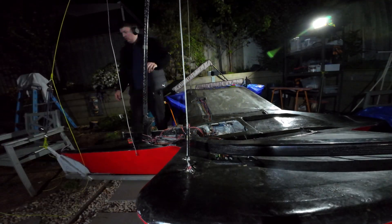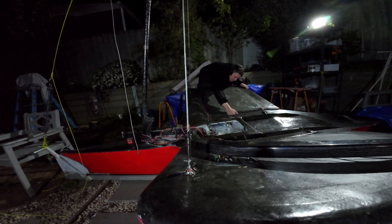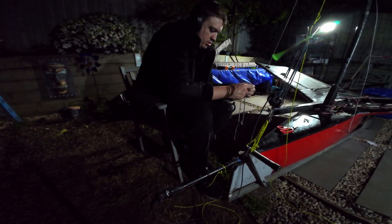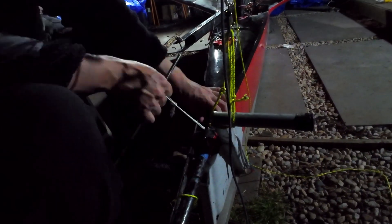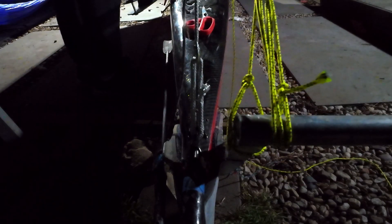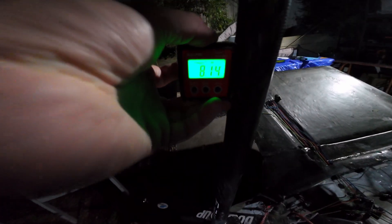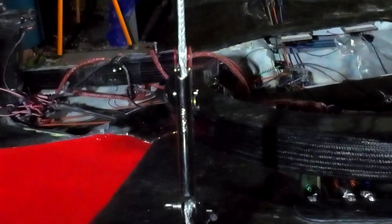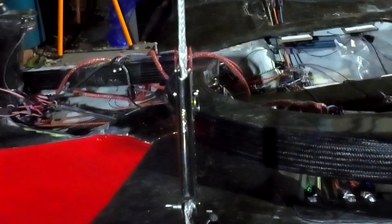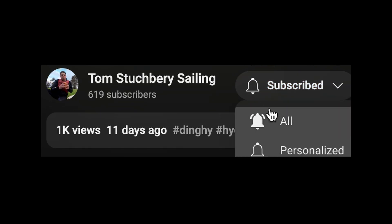In the comments, Rob USA 4301 mentioned you want about eight to nine degrees of rake measured from the flat of the hull on a Mach 2. I was able to end up at about 8.5 to 8.6 degrees, so I'm really happy with where it ended up. The soft shackle I'd made for the forestay with such care in the previous episode was now way too long, so I had to make another one. I'm really glad I did pre-stretch them properly, because they stretched from the top hole of the side stay adjuster to about the fourth hole - a good inch that otherwise I'd be chasing my whole life under regular loads. Thanks for watching, remember to like and subscribe. Sorry about the gap in videos - I've been pushing really hard to get this boat done, but uploads should be a bit more regular now. See you next time.